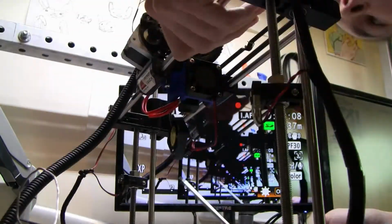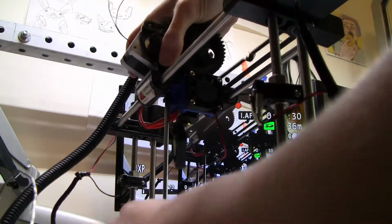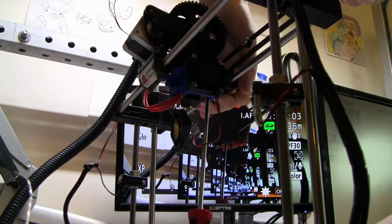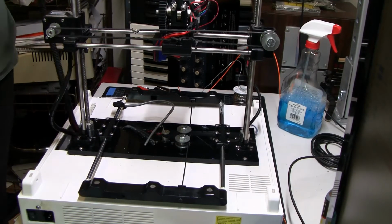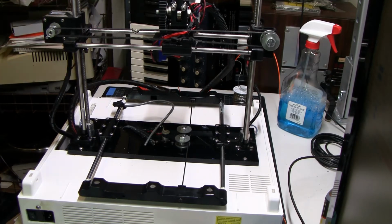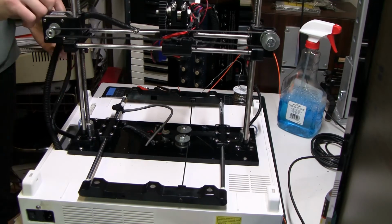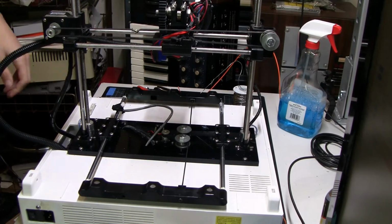And you'll also see somewhere in these clips I actually replaced the nozzle, because when I pulled it off, when I first started trying to feed filament through it, the filament just went straight through, and I realized that there was a 2mm nozzle on this thing. I didn't even know that was a possibility, but that's what was running. So I had to go steal the E3D nozzle off of my salvage CNC router stock, which is not operational right now. It came to me non-operational.